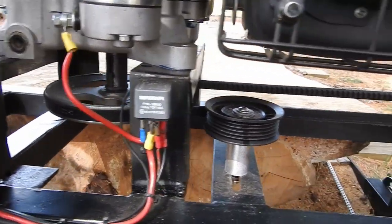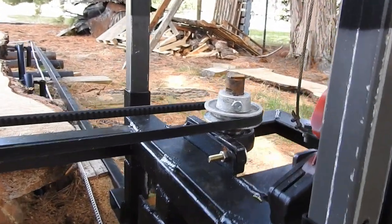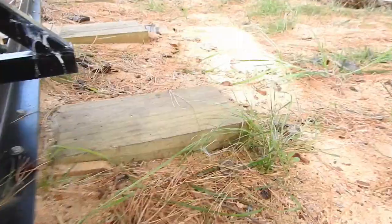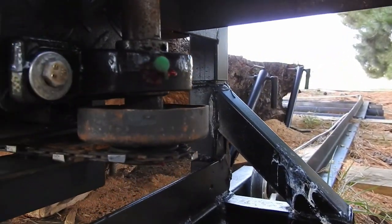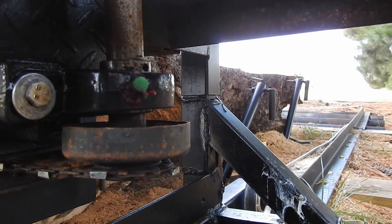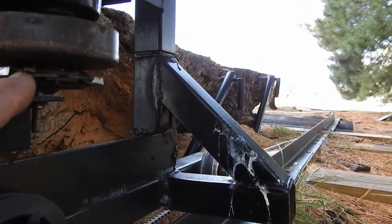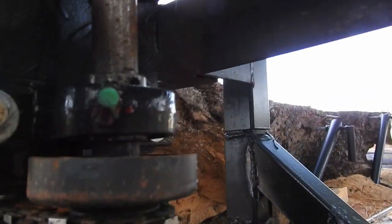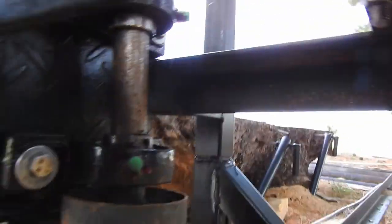There you can see the pulley, pulley tensioner, over to a smaller pulley. That goes down under here to a chainsaw clutch, which worked for a while but then it burnt out. So I ended up just welding it together. That means it's quite easy to change the standard sprockets. You can see the shaft just under two pillow bearings. And then we have the throttle.